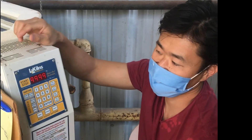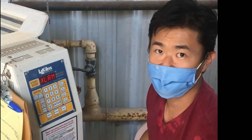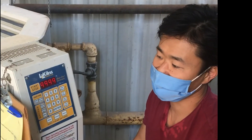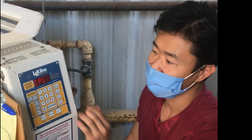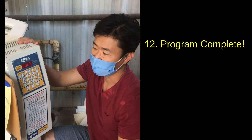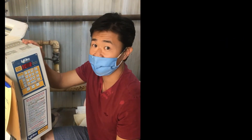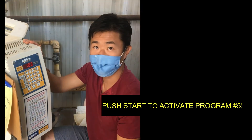Lastly, ALRM stands for alarm. It's asking what temperature you'd like it to sound the alarm. I'll say 9,999 — that's fine because we don't really need that alarm to go off. So press Enter. When it says CPL, that means complete — you have successfully entered Program number 5. If you press Start now, that will activate the very last program you input, and it will go.